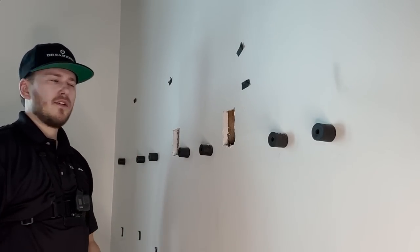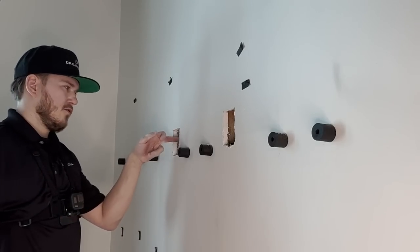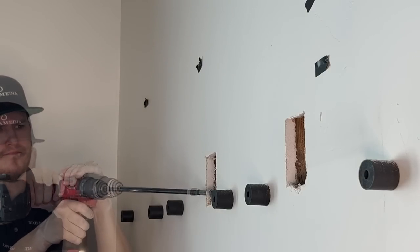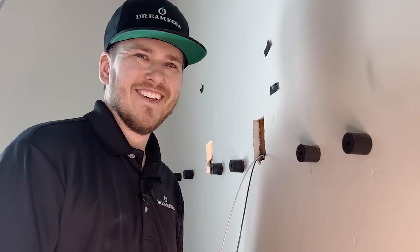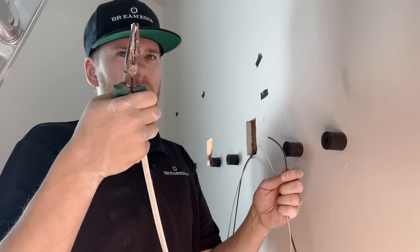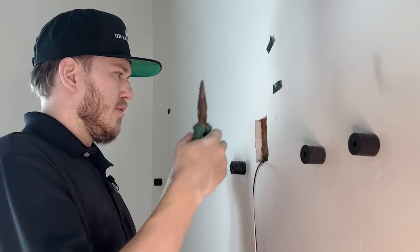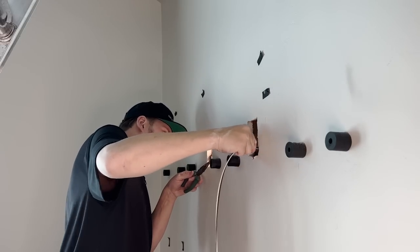In this area I have a stud here and a stud here, so I'm going to use fish tape, which is a little more flexible than a fish rod, and drill through both studs to fish it between the two. I'm having a hard time getting the wire through the wall. What I did was remove two of the conductors out of the 14-2 Romex — just the positive and neutral — and twisted them together because it was a little too thick and not sharp enough to get through that foam insulation. Now I'm finessing it through the hole with a light on this side.